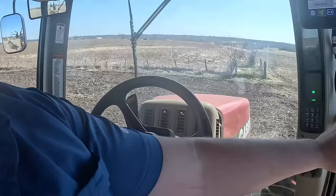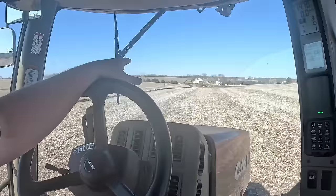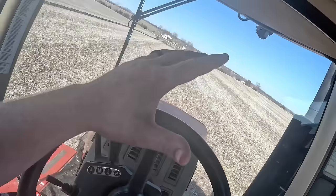We've got the first of 2 6-inch runs done. So this main that we just pulled in is gonna be the one that catches this side hill here. We're gonna do some spaced out laterals that kind of come up this side hill. I'll go survey it, but I'm pretty sure the flat where I actually have the corn maze, the pumpkin patch and stuff like that, it wants to actually drain to the south. And then there's also 2 24-inch high pressure gas lines over that way.